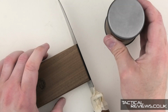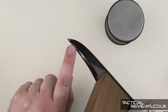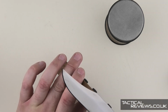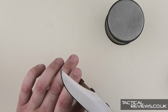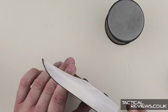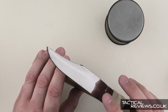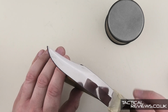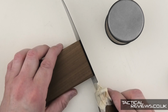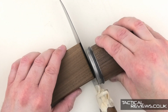So here, with the shape of the blade curving significantly more than with a kitchen knife I was working, I'm quite a long way from hitting the edge on the tip. That first pass suggests that actually I'm not quite 20 degrees, I'm probably more like 18 per side, but I don't want to go to 15 for this knife. So with those two options, 20 degrees is the angle I would go for. So it'll need a...